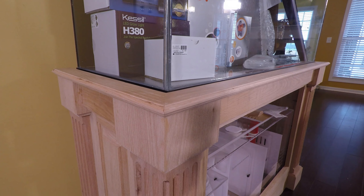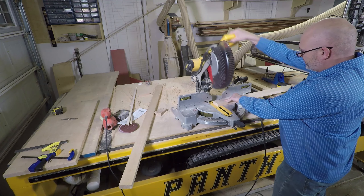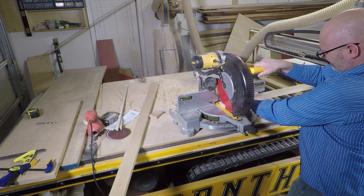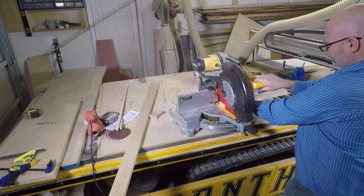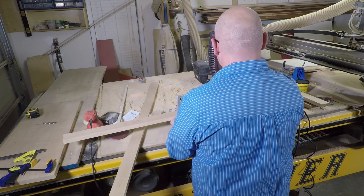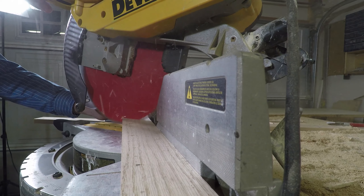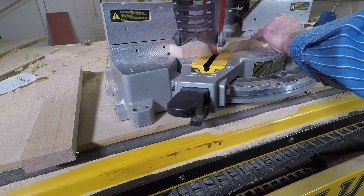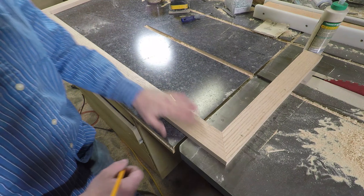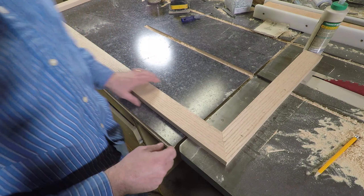And with that out of the way, we're going to begin building what I'm calling the mantelpiece. First thing I want to do is to square up one end of the board, and I'll do that with the miter saw. And now that that's square, I'll take this to the aquarium and use a pencil to mark off the length. With the piece marked, I'll move the miter to 45 degrees and make the cut. So now with all the pieces cut to length and laid out how they're going to go, I'm going to place a pencil mark in the corners of the miters — that's going to help me line up for the biscuit joiner that I'll use next.